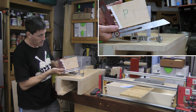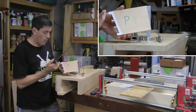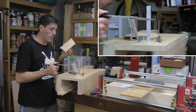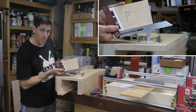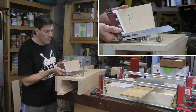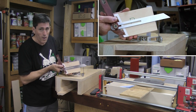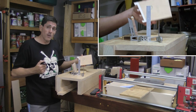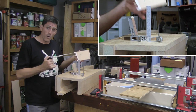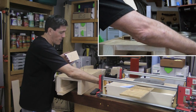That also means it would be the same as that. So while this miter doesn't match either of the other two bevel gauges, after you've marked it and done the cut, you can simply take this third bevel gauge and just set it to the miter angle that's there. Now you can mark off all those horizontals — you don't have to do the horizontal trick. I decided to use that method because it makes it more clear what you're trying to get, and it's very clear that you're getting a horizontal line to the bottom surface.